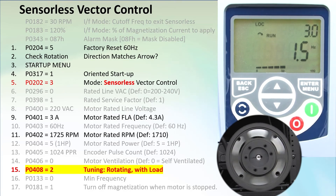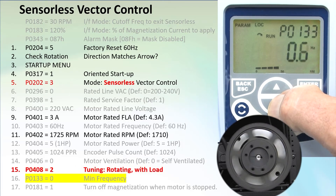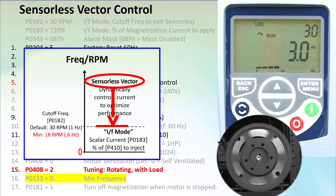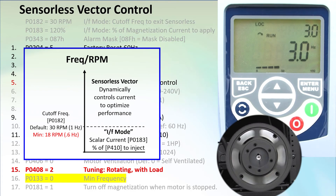Hit run and the drive spins the motor up to its default minimum frequency of 3 Hz. Let's go to parameter 133 and change the minimum frequency to 0 Hz so we can experiment with lower speeds. Sensorless vector can't go all the way down to 0 RPM — we use the default cutoff of 30 RPM, which for our 60 Hz motor is 1 Hz.